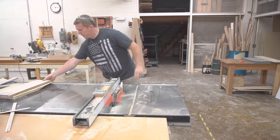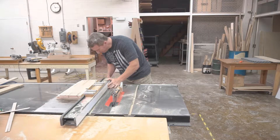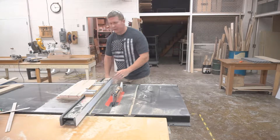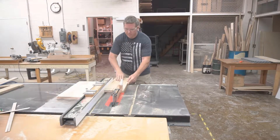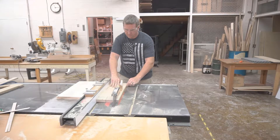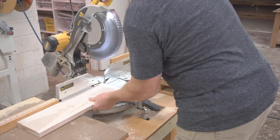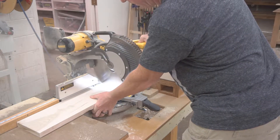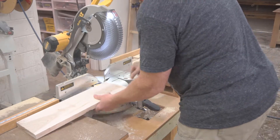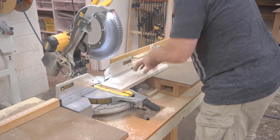For your two side pieces that we cut, I happened to find some that were wide enough. We're going to cut them to 6 inches wide, and then cut them down to 20 inches long on the chop saw behind me. Remember to always chop the end off first and take your time, because as you're cutting the end, the board tends to move away from the blade. Then slide it down to your stop and cut off the other end.